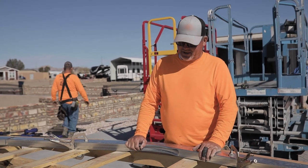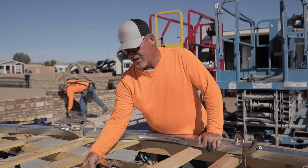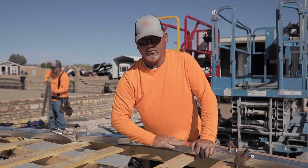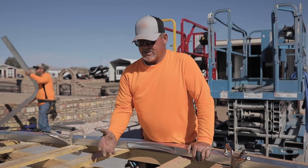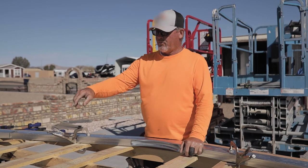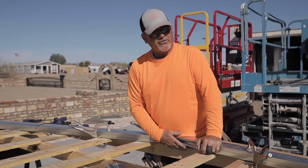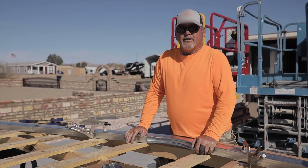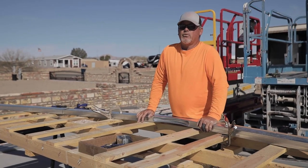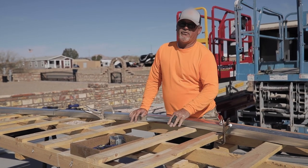Everybody wants the pallets when we're done with them. We also put a couple of one-by-fours from the package — cut our box right here so all our stuff is right here, out of the way, lower than the work surface so we can slide them right off. We prefab all our collar ties off the first truck so they're all exactly made. When we get done we're ready — it saves a lot of time when you're mocking them up.